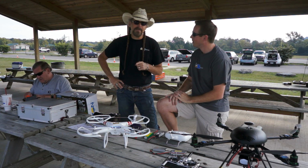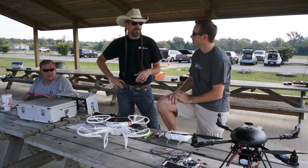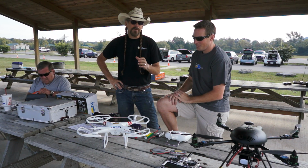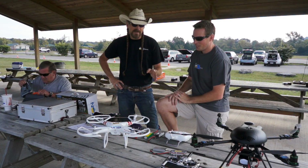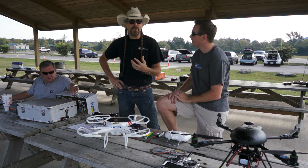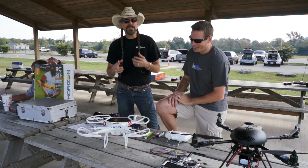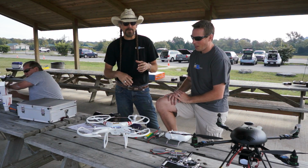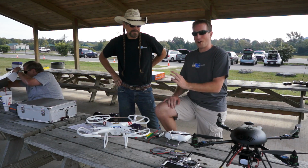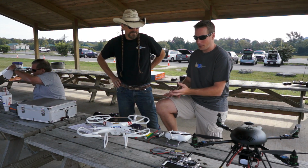Let me give you a flip side to this cool feature. If you're in your house, which I really wanted to turn this on and make sure it was rolling before I got out here, but if you're in your house and your transmitter dies, that unit will fly 60 feet into the air, which won't occur. It'll just bash into your ceiling. So you definitely don't want to do that in the house or while you're standing there. Right, and it's not going to happen when the copter's not armed and essentially already flying.